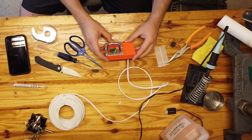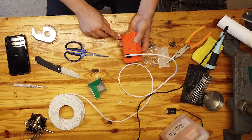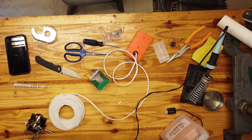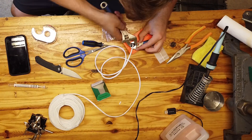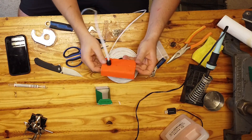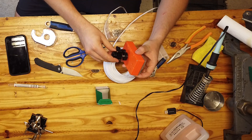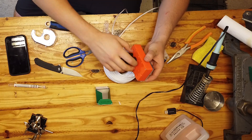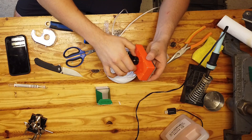The weak point in the waterproof design is definitely the cable grommet. It's allegedly submersible, but we'll see how it goes after some time outside. I got the articulating ball mount off Amazon for about $10, and it threads into one of the same quarter-20 holes used in op 2 to fix the workpiece down to the fixture plate. So all the hardware is in place and working as intended.